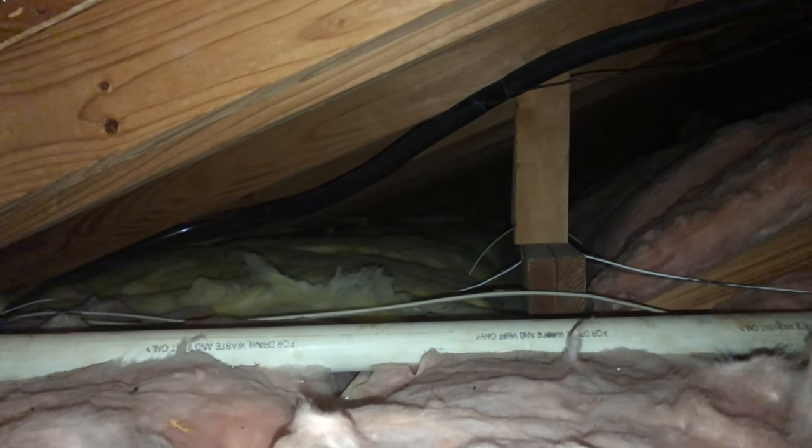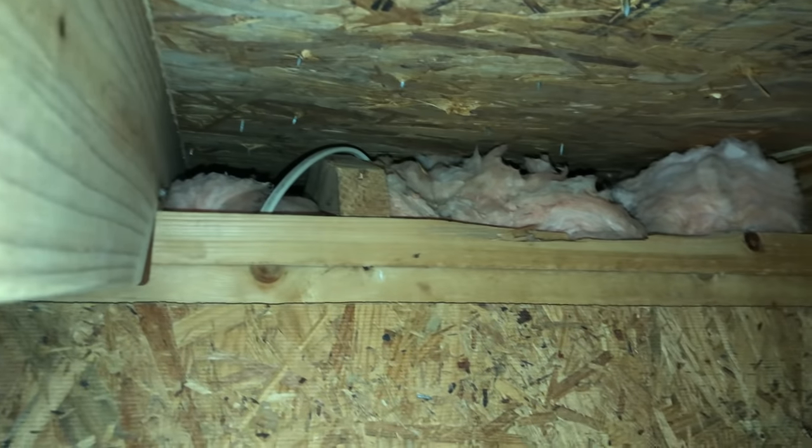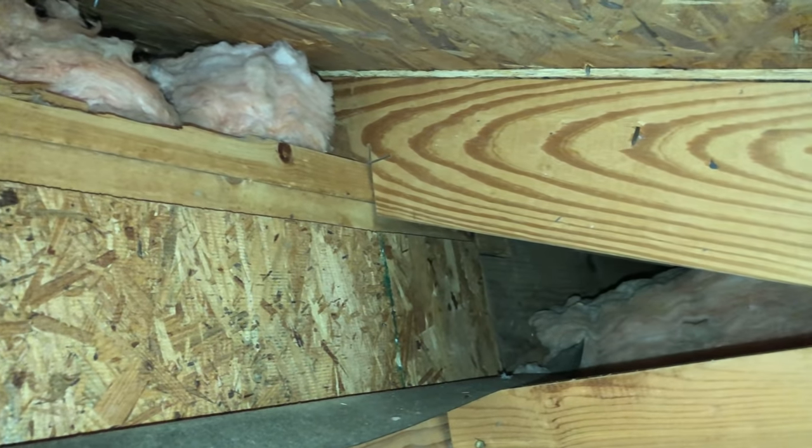I see dad trying to push the fish tape through up there, but there's just no way I'm going to be able to get that - I need to go tell him. I don't think this is going to work, dude. There's a lot going on between here and that fan location - all kinds of framing in the way. We've got this bump out, the lowered ceiling. You know there's a cathedral ceiling in that master bedroom, so we're fighting that too - we don't have an attic space above it.